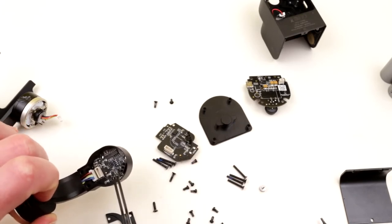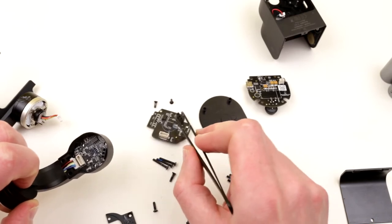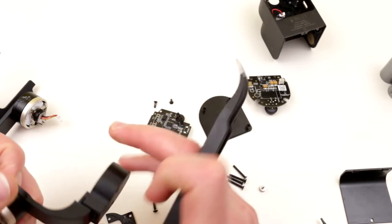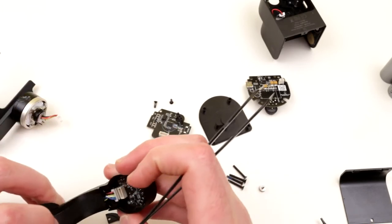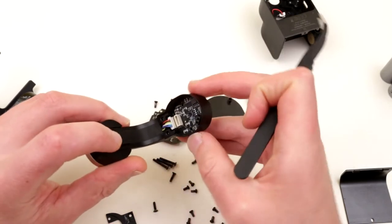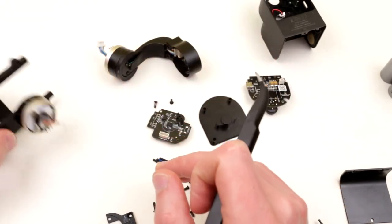We have exactly the same here — two chips and three small chips with a bunch of passives. This is the brushless driver, controlled by an STM32. I really like this design. Look at this tiny PCB containing all the driving circuits. There is another connector with four pins over here. It snaps nicely into place — really nicely engineered, pretty snug, not wobbly, and unless it takes a really hard hit it's going to stay together. This is awesome.